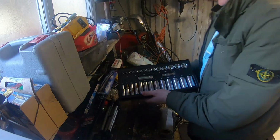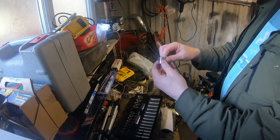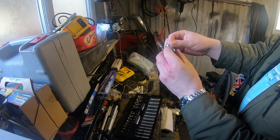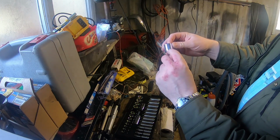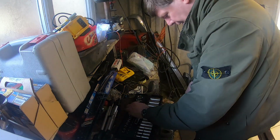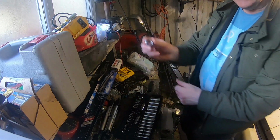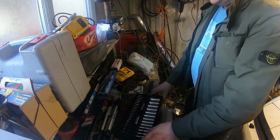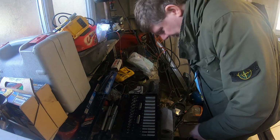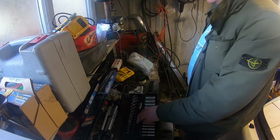And here's our socket sets. So just grab one. It's just your normal chrome socket, Halfords Advanced with the measurement. I think it's vanadium, or is it vanadium? I can't remember how it's pronounced. I'm sure somebody will correct me. And it's a 3/8 drive, so you've got your normal depth. Have you noticed a six-sided, which is quite handy, especially on cars as old as my Triumph Dolomite, where all the bolts are rusty. You get a better purchase, you less chance of rounding them off.